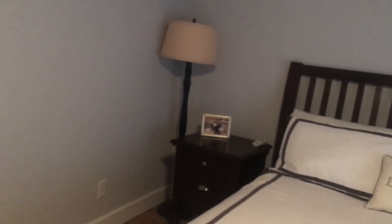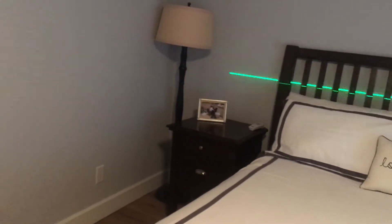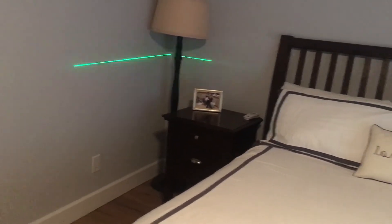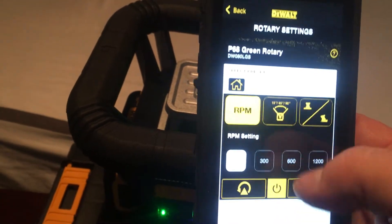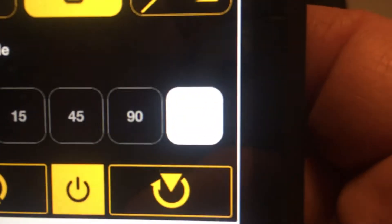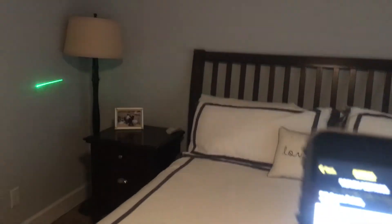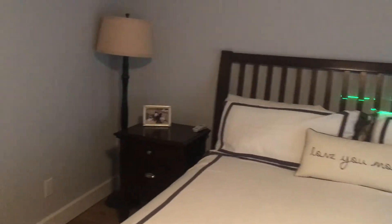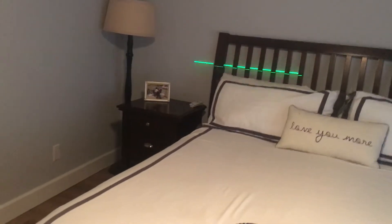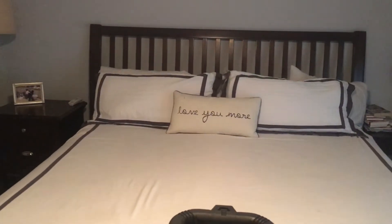At 150 RPM, this makes your line so easy to see. Imagine hanging a big long run of cabinets in a warehouse — that will be a very distinct line. If you've got another half-dozen lasers going on in there, you'll notice yours for sure. Instead of doing a full circle, you can do a sweep. This does 15 degree, 45, or 90 degree sweep. Right now it's on 360 — let's go to a 15 degree sweep. Isn't that cool? You're not going to bother anybody else while you're working. Here's a 45, here's a 90. That might be all you need for your cabs if you're just doing an L-shape.